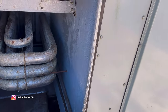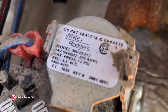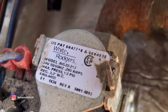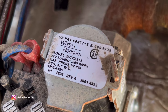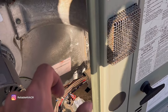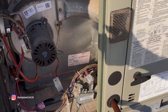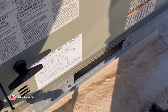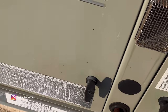I'm going to close this one off and wrap it up. In case the label on the unit can't be read for whatever reason, they do have a recommendation right there on the valve — it's rated at 3.3. You can set them: go clockwise to increase, counterclockwise to decrease on the set screw there. But I'm not going to make any adjustment — it looks pretty spot on.